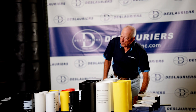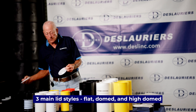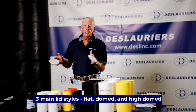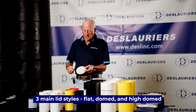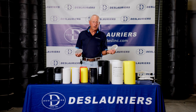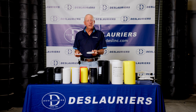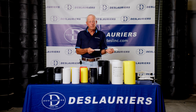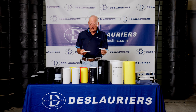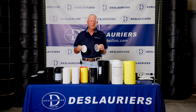In addition to the tamping rods and the molds themselves, we also carry tight fitting lids for all sizes and styles. We have three styles of lids: flat, domed, and high domed — it's just a matter of personal preference. They all work the same. When you come back the next day to take these cylinders into the lab to be stored and cured, if you pull these lids off, they should have moisture on the inside of them, and that's how you know they're working.